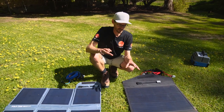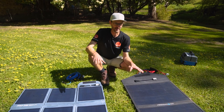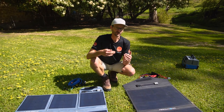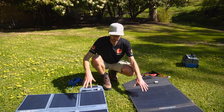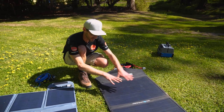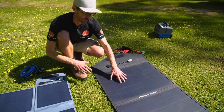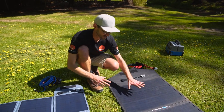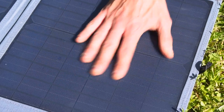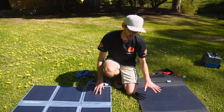Jumping into the actual solar panels themselves — they're the same A-grade monocrystalline cell, so they both have the same performance. The output of both 200-watt mats: the lifestyle puts out about 10.68 amps, the Crocskin about 11.1 amps, so there's not a lot of difference. The main distinction comes down to durability. The Crocskin has a copper cell backing with lots of points of contact, and the croc-skin armour over the top makes it quite impact-resistant — they say it's even good in hail. The lifestyle panels are still tough, not fragile by any means, but you need to treat them with more care and I probably wouldn't leave them out in hail.